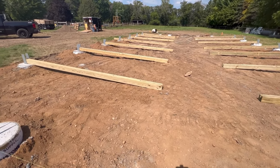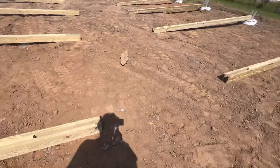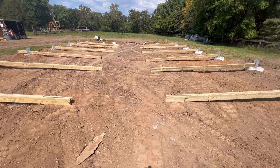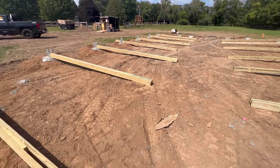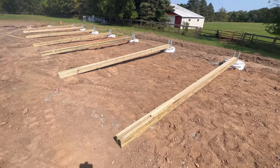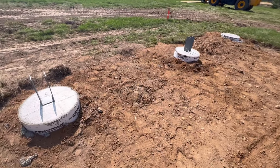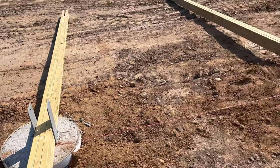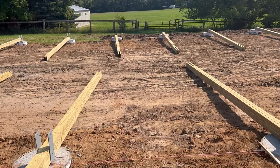All of the posts are marked and cut to length, marked out for the girt, and kind of temporarily positioned close to where they need to be. I've got a couple I need to slide around. Next step is I need 40 18-foot two-by-fours for the girt. The building is exactly 72 feet outside to outside on the posts and 40 feet side to side, so the posts are nine feet on center.